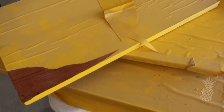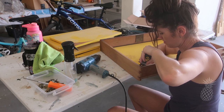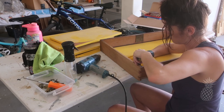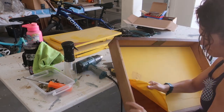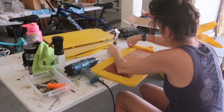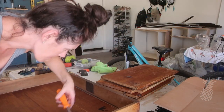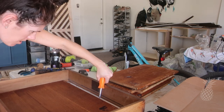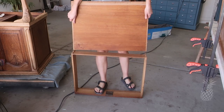These drawers are a piece of work. Someone used awful yellow contact paper all throughout this piece - on the drawers, on the shelves. This is not peel and stick, this is glue and stick. We were finally able to get it all pulled off, and then I could see what poor condition the drawers were really in. This piece is so old, this oak has shrunk at least three-eighths of an inch on almost every piece, meaning the wood drawer inserts are too small for the drawers themselves. We're going to have a lot of wiggling and rebuilding to do. This area is so hot and dry - it really sucks the moisture out of everything.